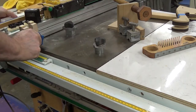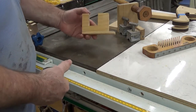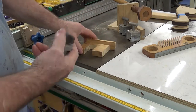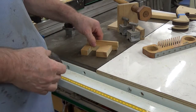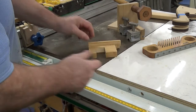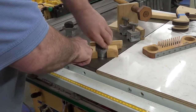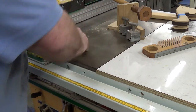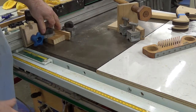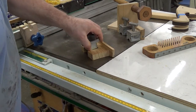Also, another jig I made — I believe this has something to do with my kerf maker, goes to show how often I make kerfs. But again, the mag switch is designed to sit in there and hold it down. The main thing is that you use the same type of mag switch throughout. Naturally, the flat screw-in type of mag switch would conflict with trying to use it for a feather board, so you might need four of the cylindrical ones.